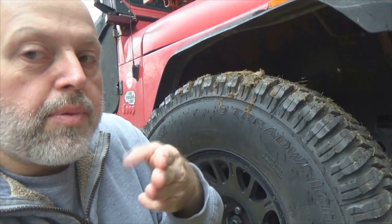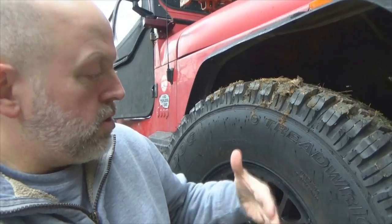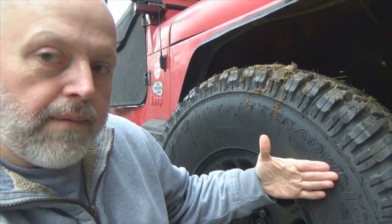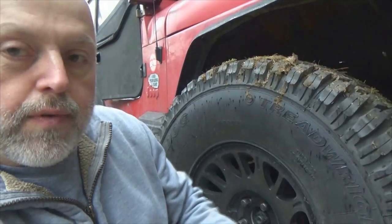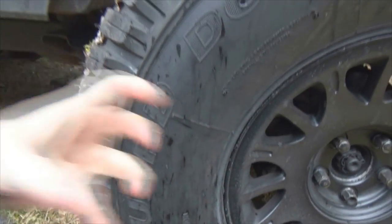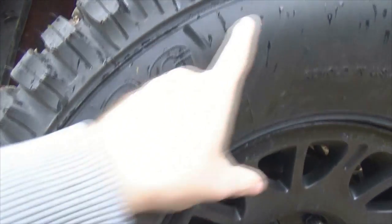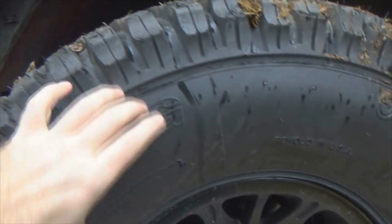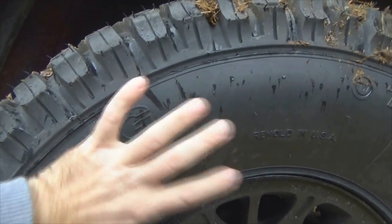After inspection, after buffing, after wrapping the brand new rubber around it, comes the remold curing process. They take this big machine and put a tube inside at 150 PSI to support the sidewalls and the tread surface. You can see right here where the mold comes together and encases the tire all the way around, heating up to 300-plus degrees for 68 minutes to cure the tire. That's where the tread mold and the side molds come in to heat all the rubber and cure it out.